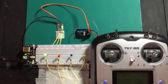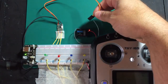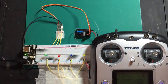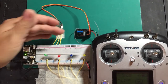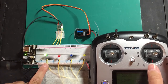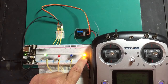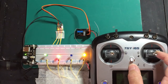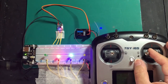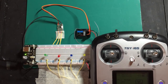I'm going to leave it on mode one because that's the first mode I'll cover in the next video. When in that mode, you can just leave it — after 30 seconds the unit will go back out of programming mode, or you can simply power the unit off by pulling it out of the receiver. I'll plug mine back in — the unit has done nothing, it's just ready to go. Mode one allows output one to come on with a left stick and output four to come off with a right stick, and holding left gets number two, holding right gets number three.